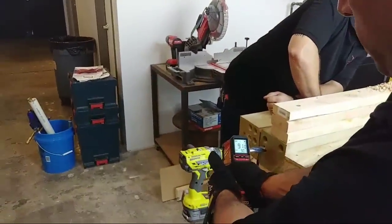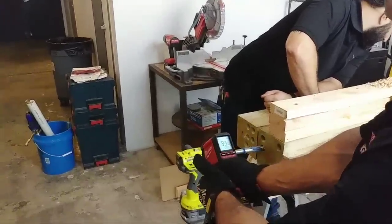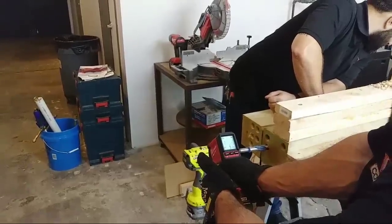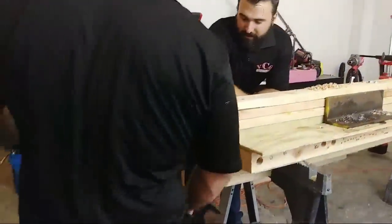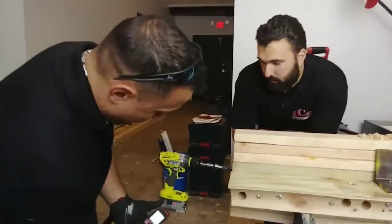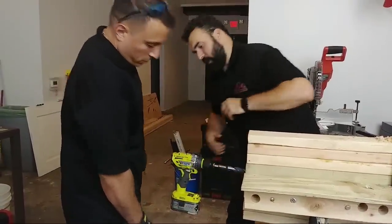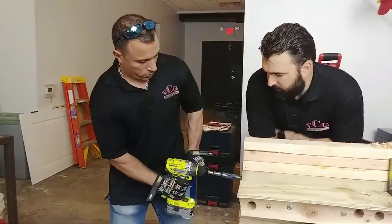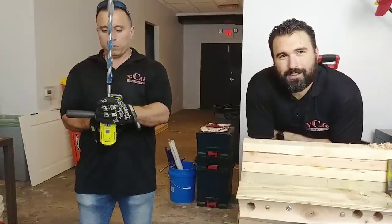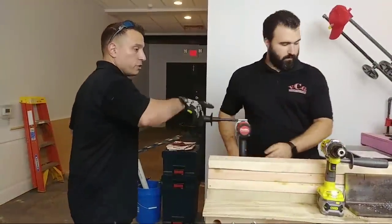Okay, so it's up to 95-96 degrees here at the gear case. Back at the rear, it's at about 110-113. Now, somebody should take the battery out and put it back in. I was actually thinking that too. Battery's at about 88 degrees. Loosen the chuck and use the Milwaukee to take it out. Yeah, I'll try that. Oh, snap. It's like a reset. That's what happened the first time with the reading, right? Okay, so how many inches do we have left? 4.5 inches.